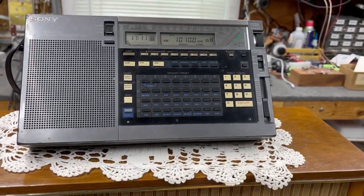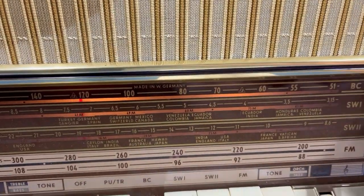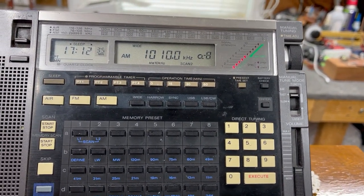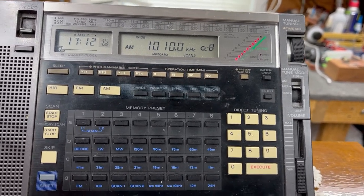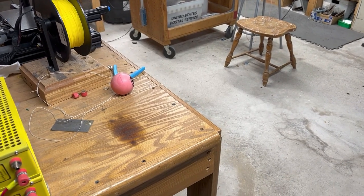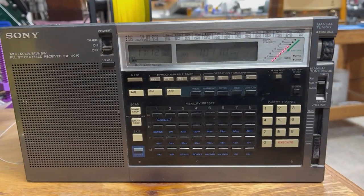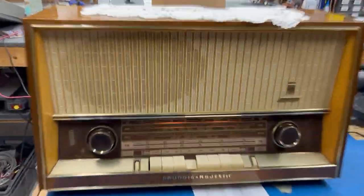So I'm tuned to WINS at 1010. Now I'm going to tune this radio down here to about 1010 — pretty strong. Now I'm going down to find that local oscillator. Here's the big carrier — the local oscillator. And we're going to move that radio over here, which is about 10 feet away, and do the same demonstration. So let's take that radio with its almost full-pin signal.